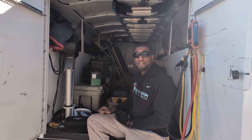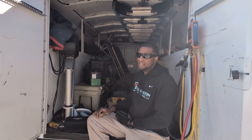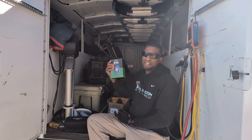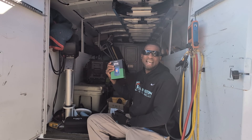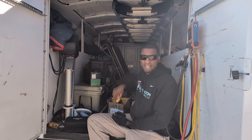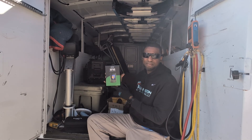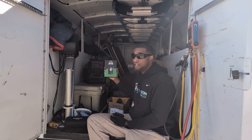I'm going to do a maintenance right now. I'm going to just check the heat. All I'm going to do is shine the Thermo Imaging Camera at the diffuser, and I can tell if it's heating or not. It doesn't have to be exact. If I want the exact temperature, I might pull out something like this, check the amps. This is electric heat, so we're going to take this inside the building and do real world use cases with these Thermo Imaging cameras.